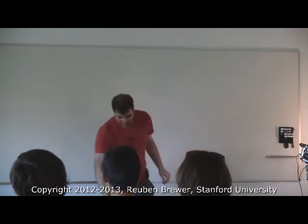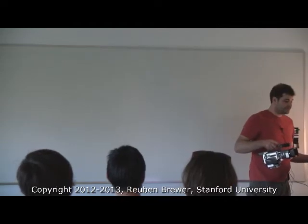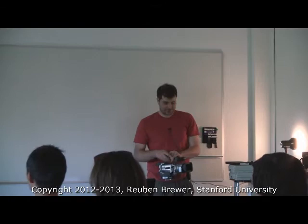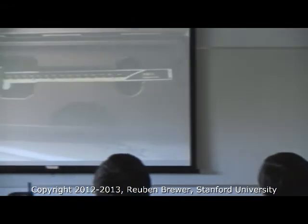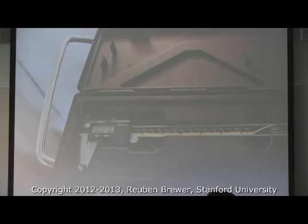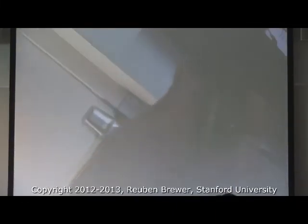So let's start off by talking about calipers. These are calipers. Now, tell me something obvious about this picture — stunningly obvious. It's in a box. This is where calipers should always be unless you're actively making a measurement. Inside these, in the manual or dial gauge version, you have a very tiny little rack and pinion. If it gets dust in there, it's destroyed — like, common dust.